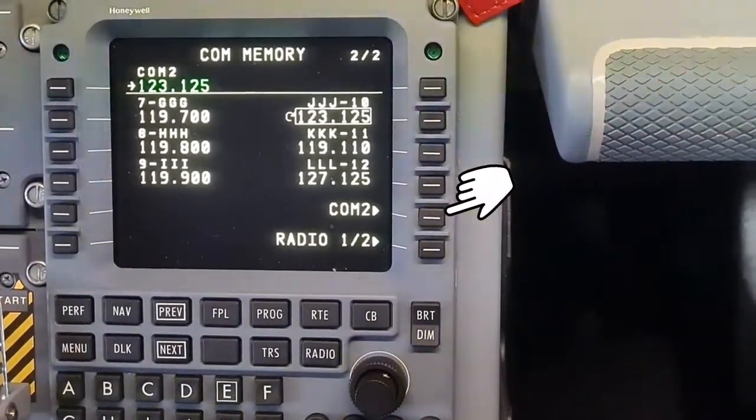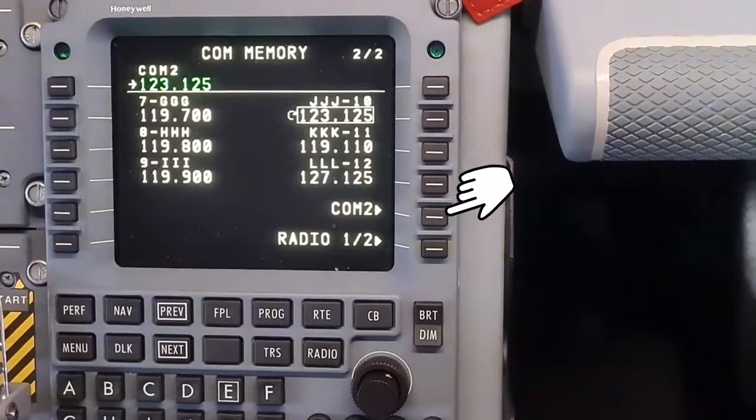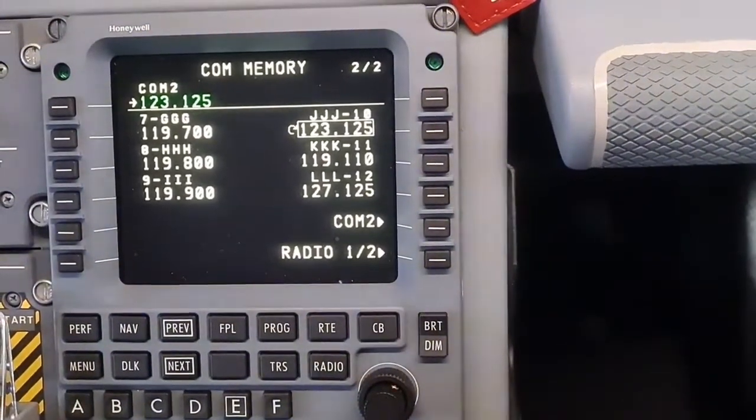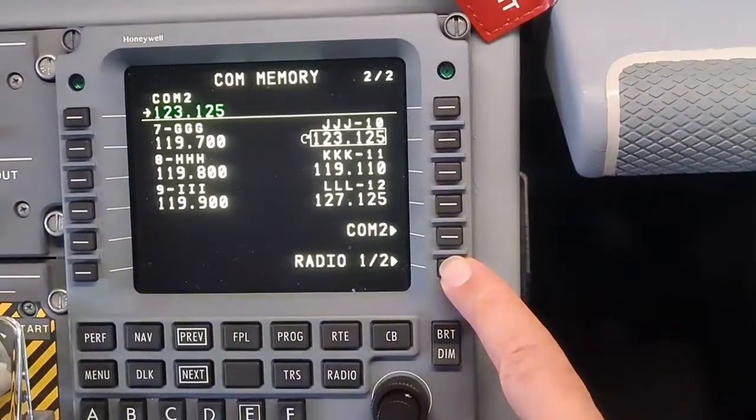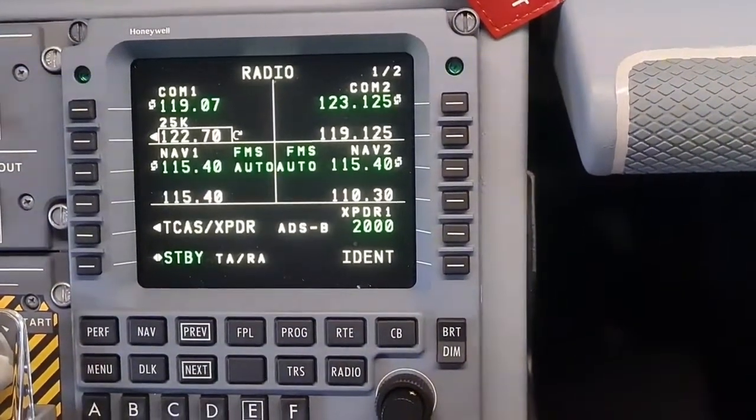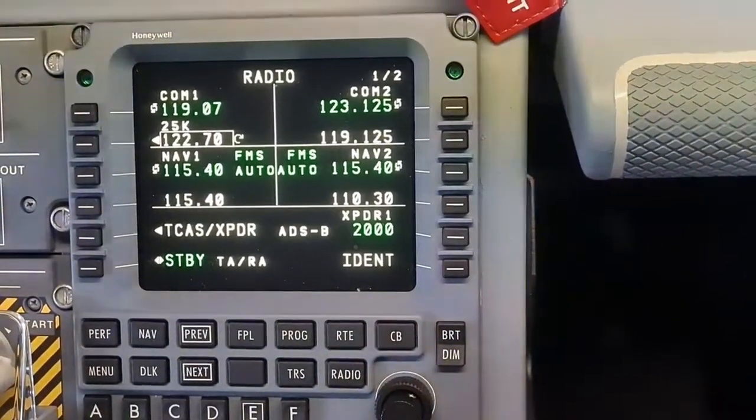To go back to COM2, click on LSK number 5 on the right. If you want to go to the main radio page, please press the 6th LSK on the same side. The procedure is complete. In the next video, we'll see how to switch COM3 from data to voice mode.